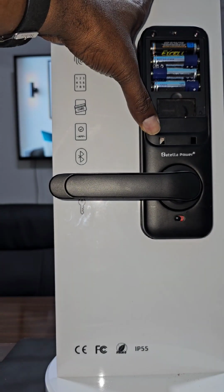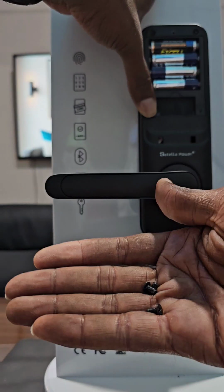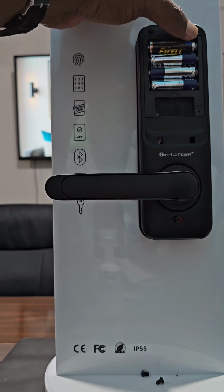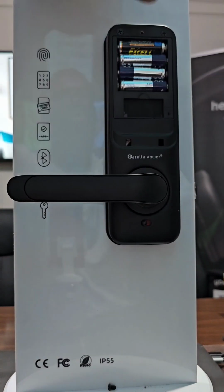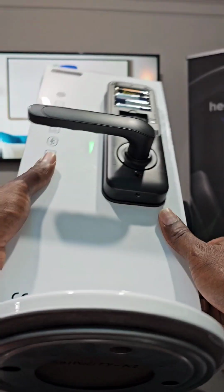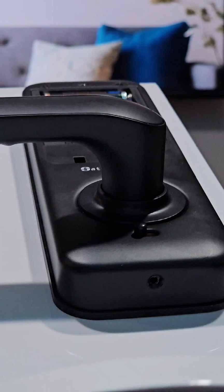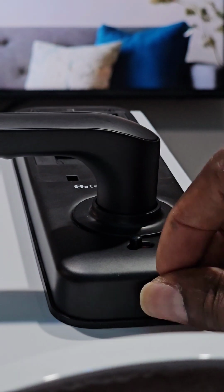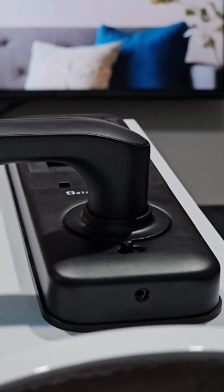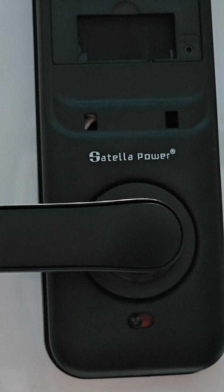Now at this point, what you will want to do is to screw. You have 3 black screws that come with the pack. Those black screws. So you will have to put 1, 2 on the top. So let me do this. So you will secure those 2 top screws over here. One here, one here. And then you have another one that goes on the bottom. So if you look on the bottom, you see over here. Let's zoom in. There you go, right here. You will have one that goes in. Now the way it works, you want to make sure that this plate is pushing down correctly so it can go through. So let's do this. So you can see here you have your other screw that will be in. Eventually your door won't be this way, it will have more room. You will be able to put your screwdriver correctly and you're all set.